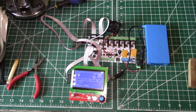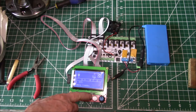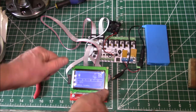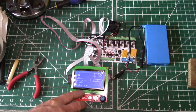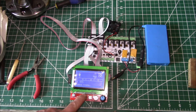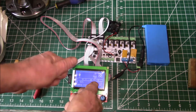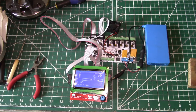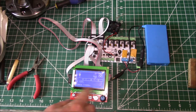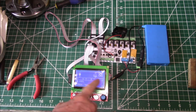There were dozens of comments — some people saying theirs worked fine, some saying it didn't. One guy said he shorted a couple of pins together and got it working; somebody else said they flexed the circuit board because some interconnect pins go through a pin header. The two boards I have are all soldered. I looked at them under a magnifying glass and couldn't see any bad solder joints, and tried flexing the boards, but nothing helped.